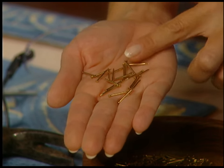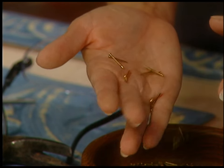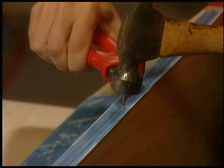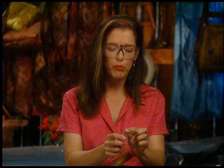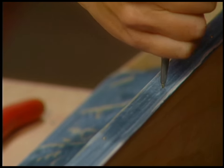For tacking, I'm using little escutcheon pins — they look brass but they're actually steel with bronze powder or brass plating. They're so tiny that you have to hold them in your pliers near the head, put them in place, and get them started through the tin. Don't drive them all the way in, because then you take a nail set — which has a perfect dome-shaped tip — and it goes right over the dome-shaped escutcheon pin and sinks it in cleanly.